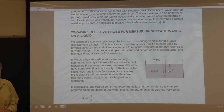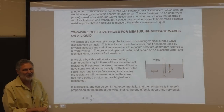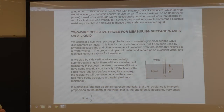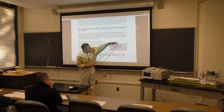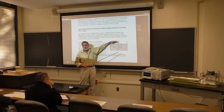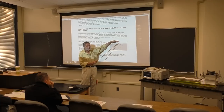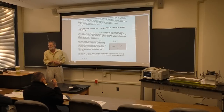This is how transducers work - people come up with a great idea, and then the trouble starts, one thing after another. Which way does the resistance go? If the depth increases, if the height goes up here, does the resistance go up or down? It goes down. You can think of this as effectively having a bunch of parallel resistors. When the depth increases, we're adding more resistors in parallel, and that lowers the equivalent resistance.